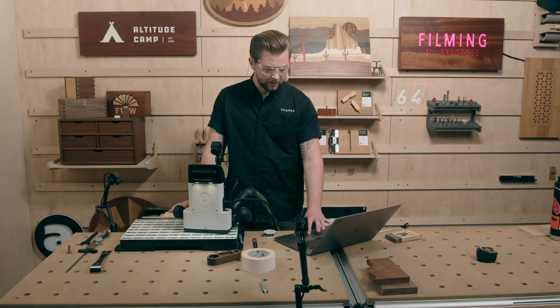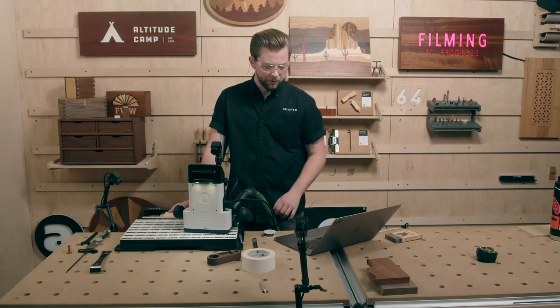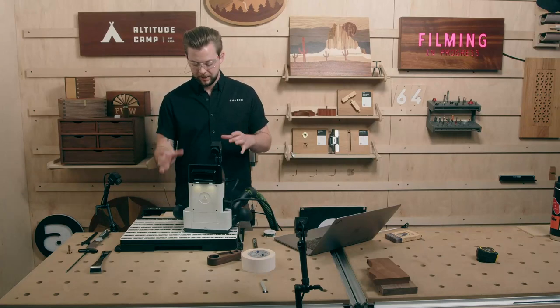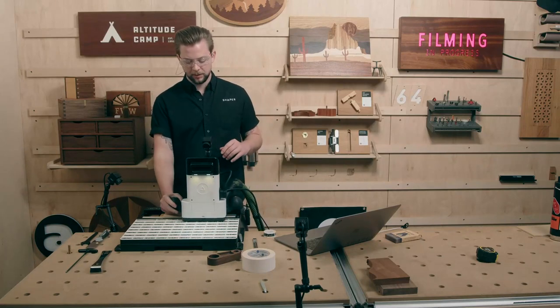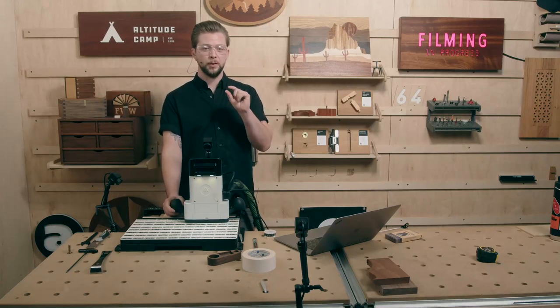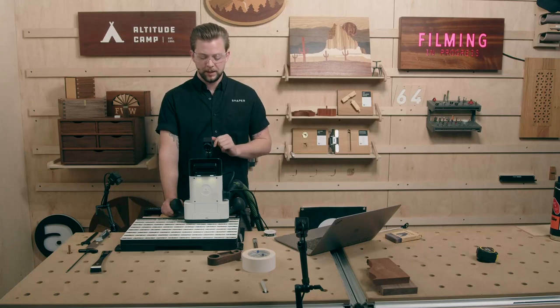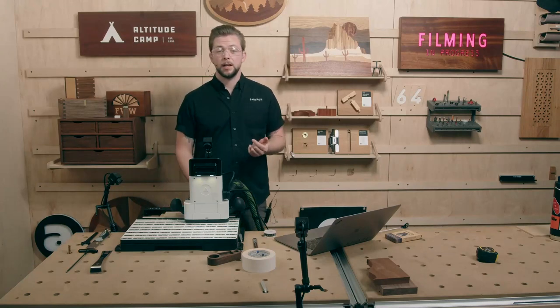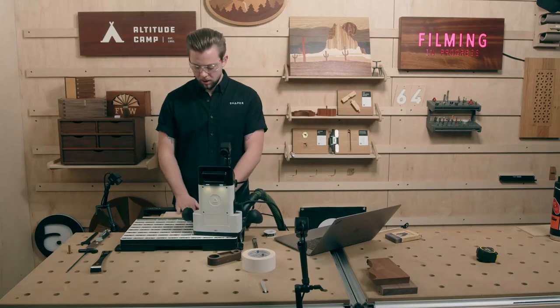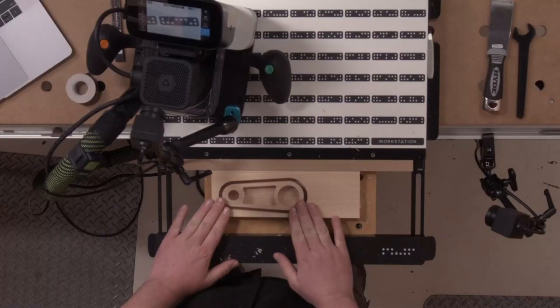All right, on to step 15. Finish cuts. We're taking that offset away and coming into our final diameter, our final dimension on the outside, but we're still not cutting all the way through. We're leaving about a 0.05 skin on the bottom. This is a really good tactic whenever you're cutting small things. I would say this is more along the size of safe.